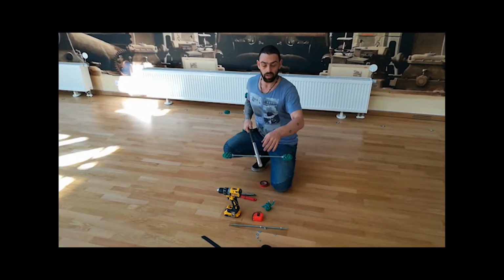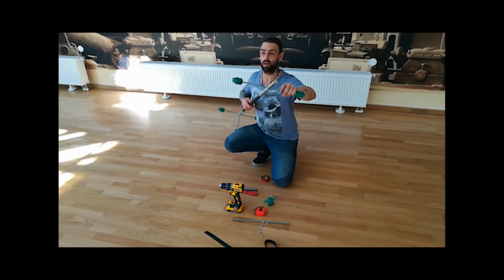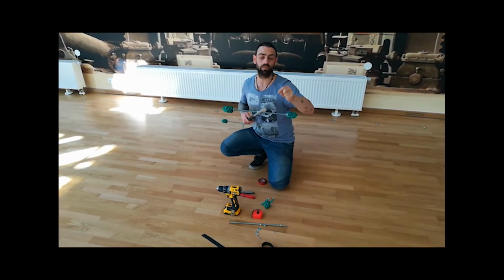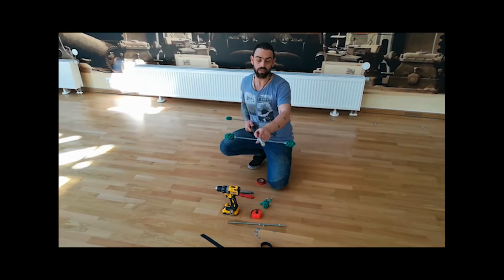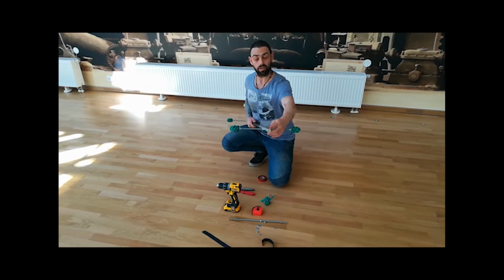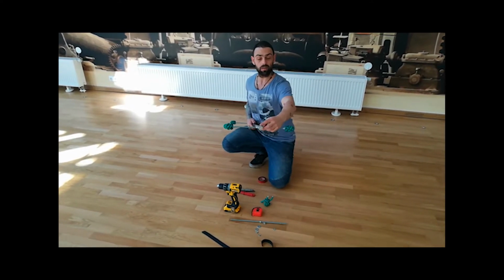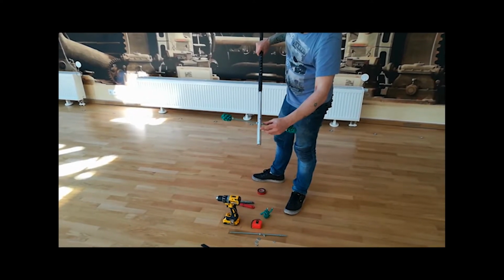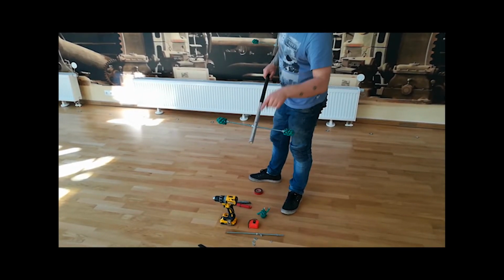Start off with 8mm, or you can use 3/8 threaded rod. Get the drill bit which works for whatever rod you're going to use. Start off where you've got to center it. If you're going to use 50mm, come in 100mm. Basically, where you do the spokes is 50mm away from the edge of where the wick's going to be. So that's where the wick's going to be, and you want a 50mm gap. Right, so drill your first hole through.